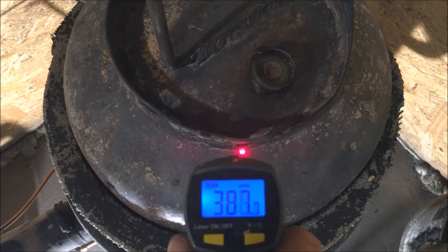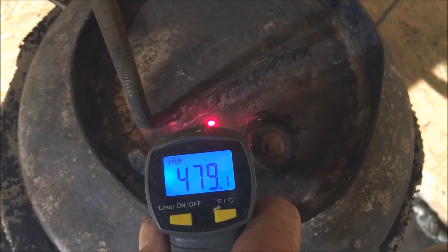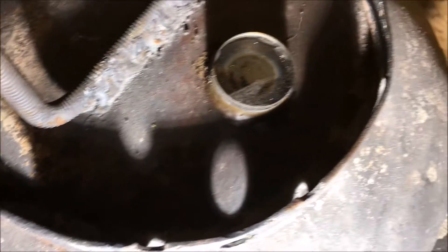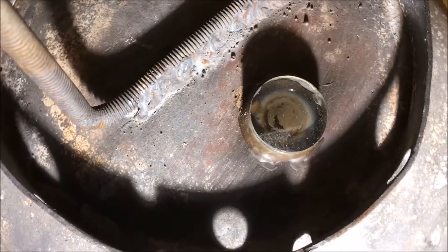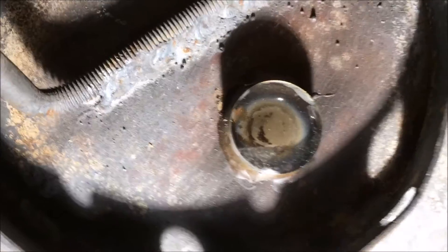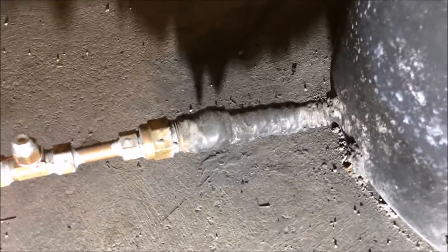Okay, it's the next day. This thing was really hot earlier — I'm at almost the 500-degree limit of the JB Weld. It is turning brown, but it doesn't have any cracks or anything starting in it yet. It doesn't seem like it's going to fail. After a while I'll get more footage. Earlier I grabbed it by the glass side and lifted it up and tried to tear it off, and it still wouldn't come off.